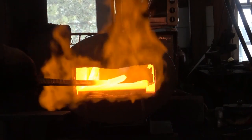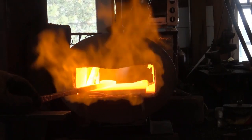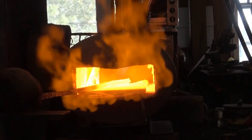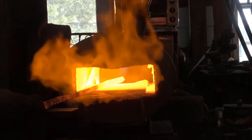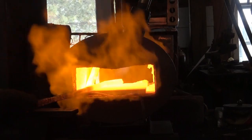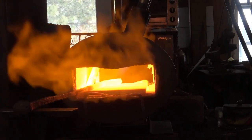I brought the forge up to welding heat and I judge it mostly by experience and knowing what pressure to set it at. The color I see here is a very bright orange bordering on glowing yellow — it is certainly not a white heat nor a bright yellow heat. One way I judge if the piece is hot enough is whether it is the same color as the floor of the forge, and if I move it, is there a cold spot under it. There is not, and it is the same color.